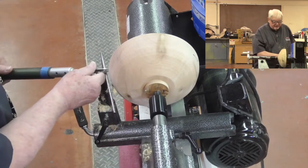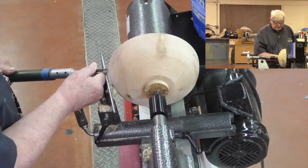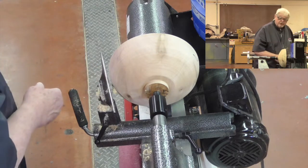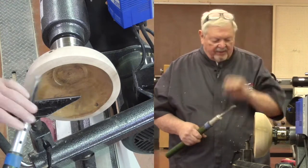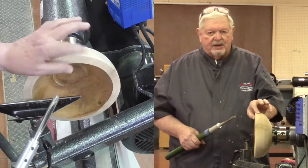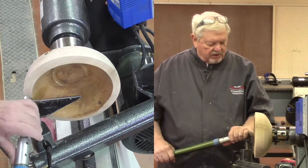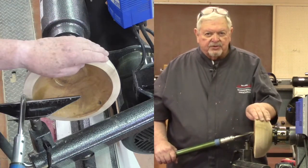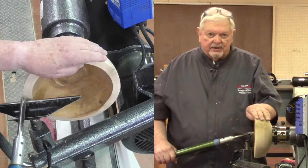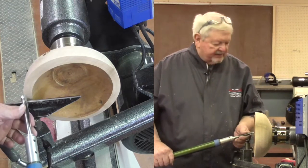Can I cut from the rim back this direction while the bowl is in this position? Sure I can, but I've got to recognize what's going on. When I make this cut I'm cutting against the full fibers — they're laying down like this and cutting across them works. But the biggest problem with the catch here is I'm going to go into this edge with an edge tool and there's nothing behind this bevel supporting it. It is an unsupported cut, so I have to anchor to the tool rest and approach the wood very carefully.